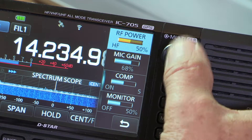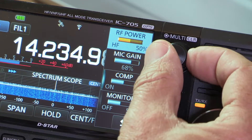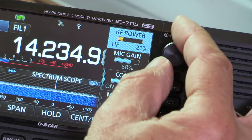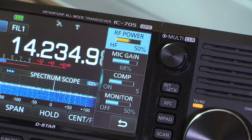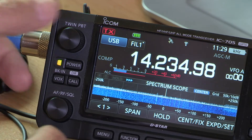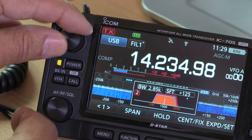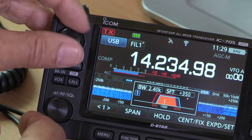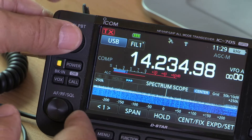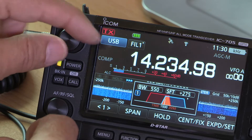Across the other side there's a button called MULTI that has multiple functions. Press it once and you get a variety of options. The top one is RF power — currently at 50% — but you can only go up to 50% on battery; plugged into an external supply it would adjust all the way to 100%. When bands get crowded you can narrow the IF bandwidth using twin passband tuning: one click brings up a picture and you can narrow the bandwidth by moving filter 1 one way and filter 2 the other way, or shift them both to one side of the frequency.